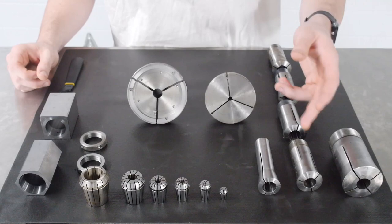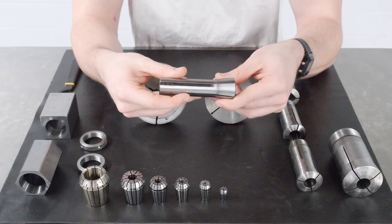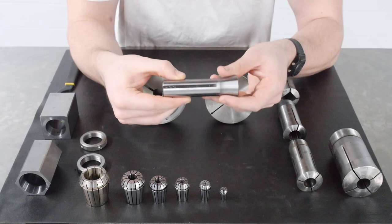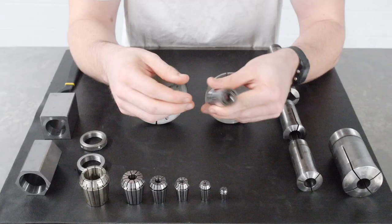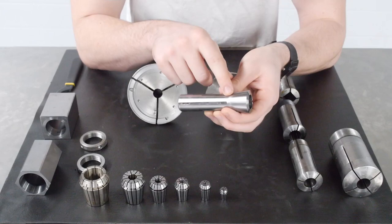The first type we're going to discuss is an R8 collet. Many of you should already have experience with this. R8 collets are generally used for tool holding in manual milling machines — you'll note in the lab that we have a collet rack on the left side of each of the Bridgeports. There are female threads in the back of the collet that engage with the drawbar when the drawbar controls are activated on the milling machine, causing the collet to be pulled up into the machine so the flexures on the front compress, providing a clamping force on your tool.